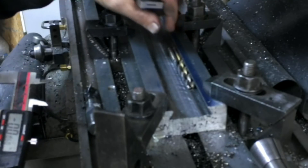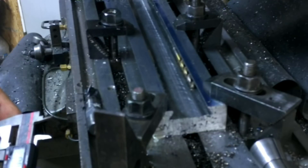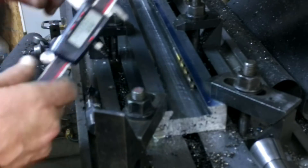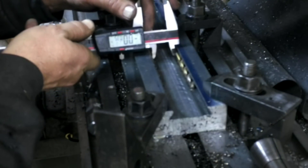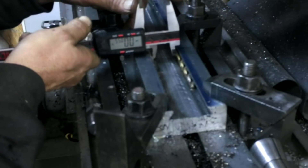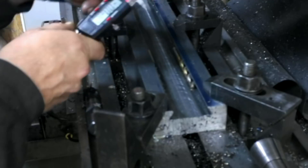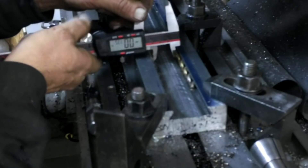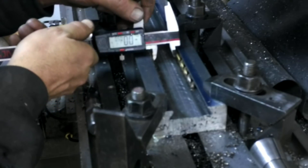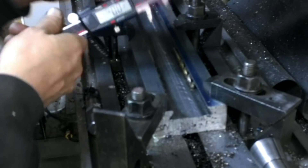I got these in, dropped my quarter-inch drills in, and I am so close to fitting. I had 22 and a half to take off each side. Got my caliper set at zero, and when I'm holding it in there, it's showing four and a half thousandths. Never got five there, but there's four and a half — four and a half to five — so that would have been two and a half per side.